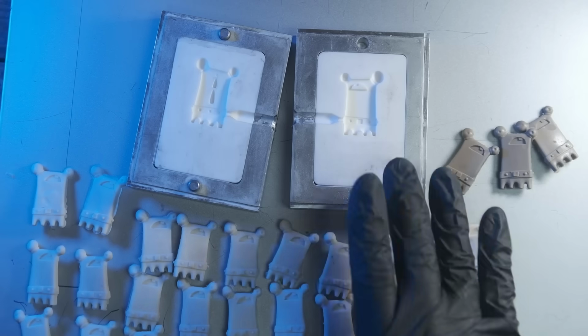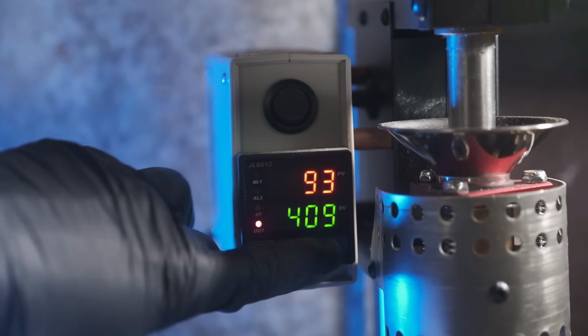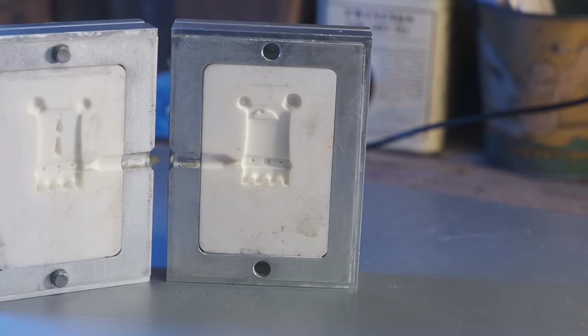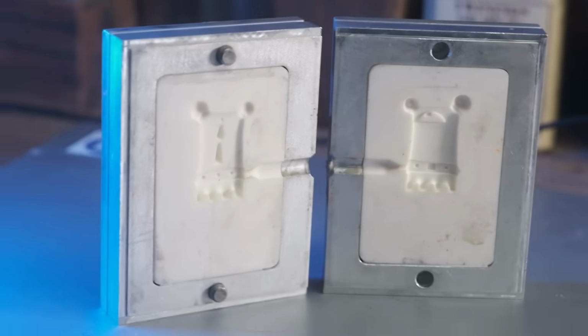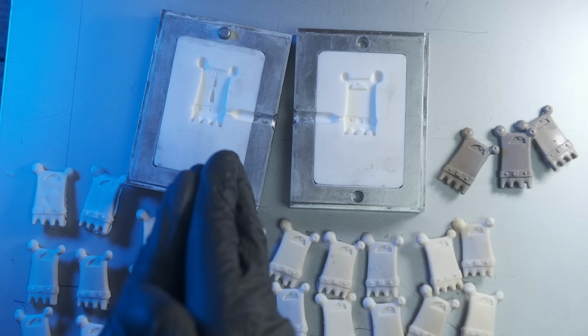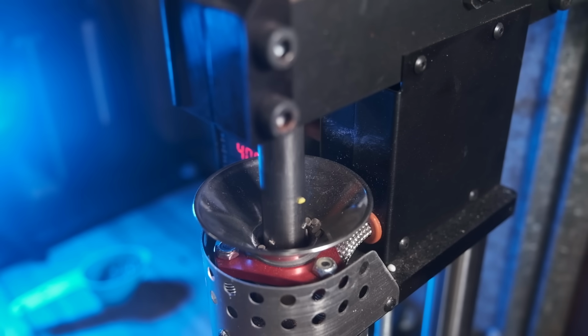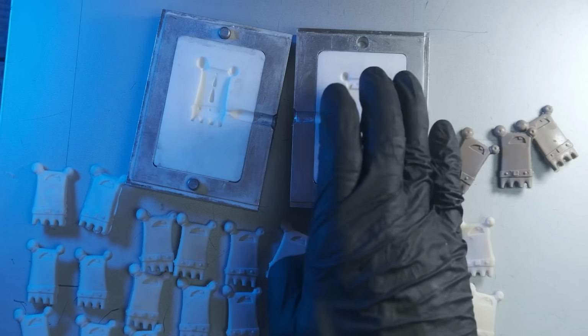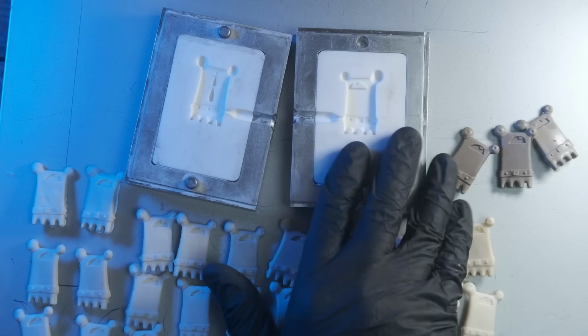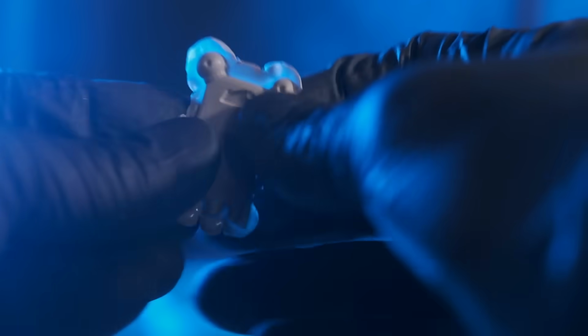To be honest, I was only a little bit concerned with the heat. My biggest concern was, is the pressure going to crack the print? Not only the pressure from just being clamped enough, but the pressure from that thermoplastic coming in, pushing against the mold. There are different ways it could crack it. And also knowing I did not have this German precision 100% flush to the surface.